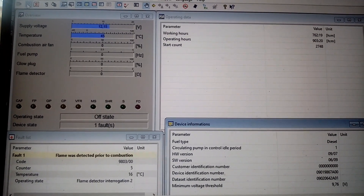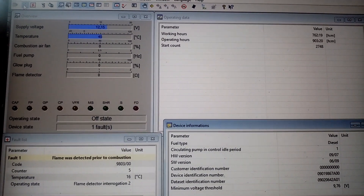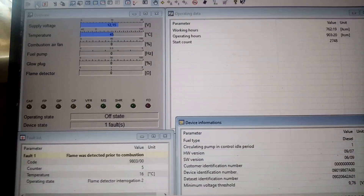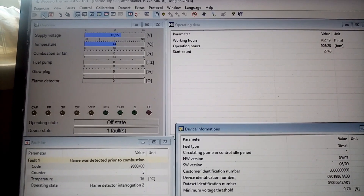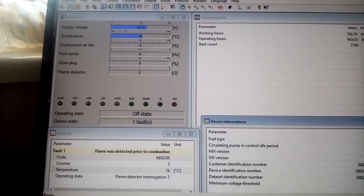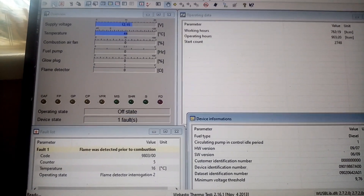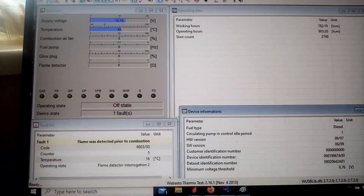This type of CPU that Webasto have used in this type of board is obviously cheaper than the bigger Motorola ones, and it's just not going to last. Like some of these BMW ones, Rover ones — the original ones — they're 30 years old now. I have BMW boards in for reprogramming all the time. The EEPROM is a collection of transistors as switches, as gates to give the stream of zeros and ones, and they've been programmed and locked in that state for 30 years. Then I come and reprogram them and they take a program absolutely fine — we've never, touch wood, had a bad CPU on one of them.